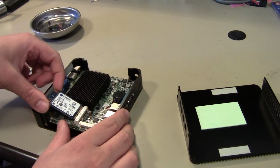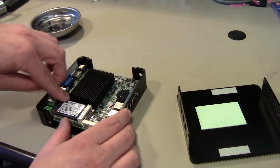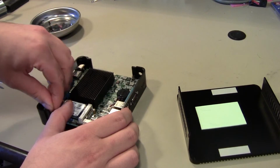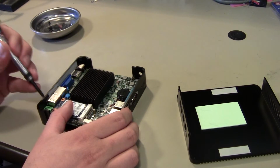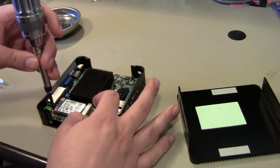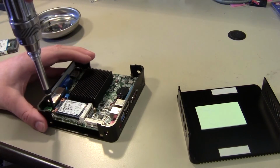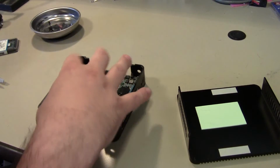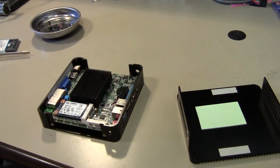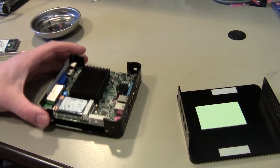And this just seats in that connector, which is indistinguishable from mPCIe, but is, I believe, totally different. On some motherboards they'll have two, the ones that support full-length PCIe cards instead of only the half-length one that you have here. You'll need to be careful about which one's the mSATA port and which one's the mPCIe port, because I don't think they're interchangeable, which is probably part of the reason why this storage standard was so short-lived.